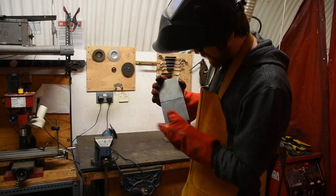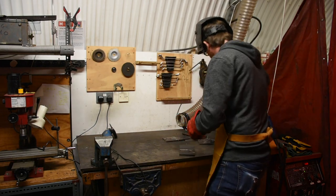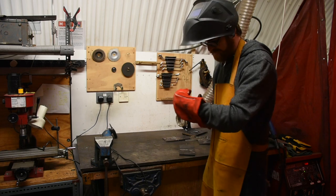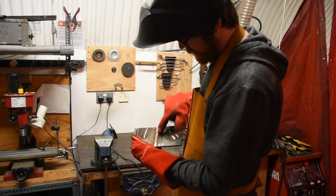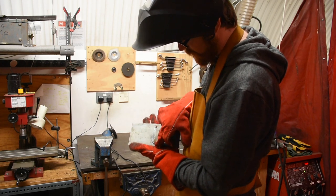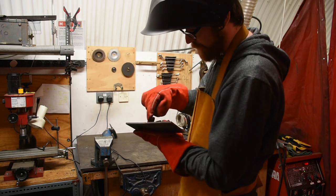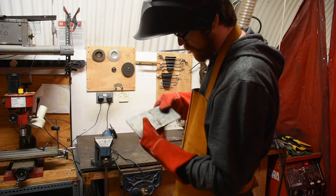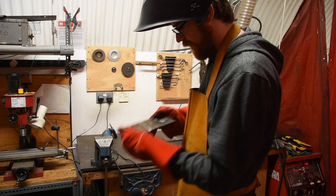It's a little hard to tell in the video, but you can see a little bit of the heat-affected zone on the back side. We have a nice thick weld bead here with good consistency, and especially right when it's hot we can see the heat that has come through in the heat-affected zone of the material. Although it's harder to get penetration on corners without blowout, we can see the metal was quite warm and we had penetrated through there. So that's a good example.